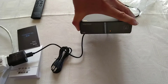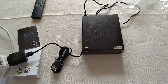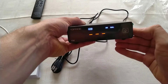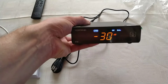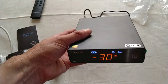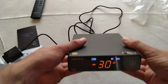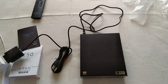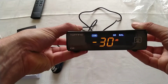We get a little red light on it. You can turn it on without the remote — and yes, it works. It starts at minus 30dB, which is useful: if your amplifier is set to maximum power and your speakers can't handle it, and somebody turns this on at maximum volume, you could blow something up. So that's a good safe default setting.